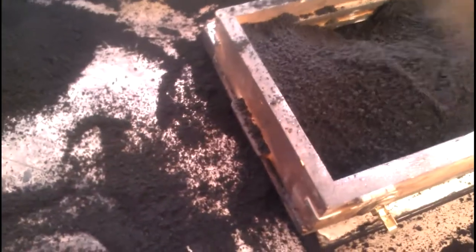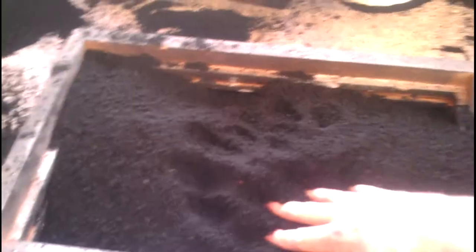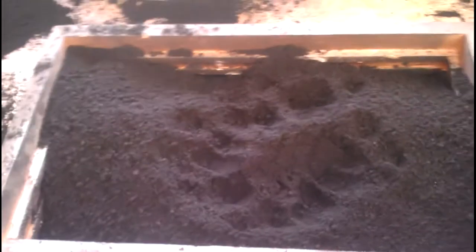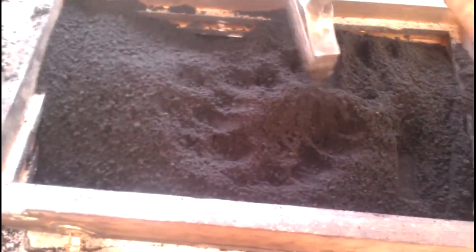This is just a test run to make sure this pattern comes out good. If we were doing it for real we would put another grade of sand on there — it's called facing sand, which is finer. Okay, so now we're going to tamp this all down.